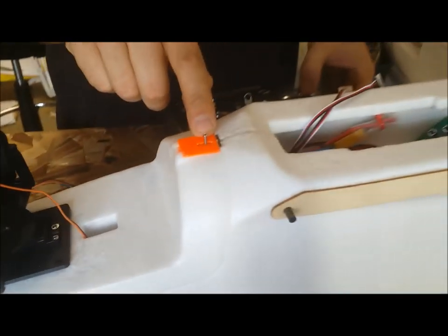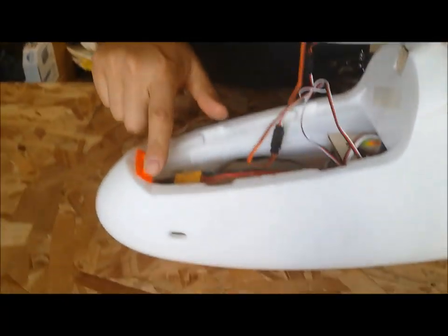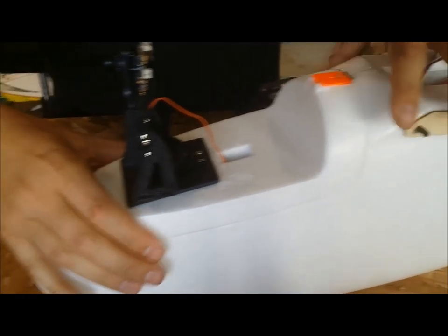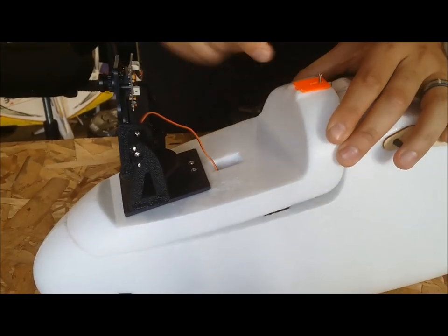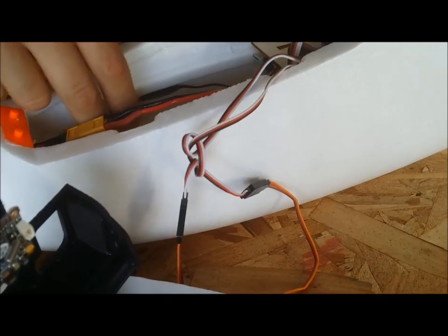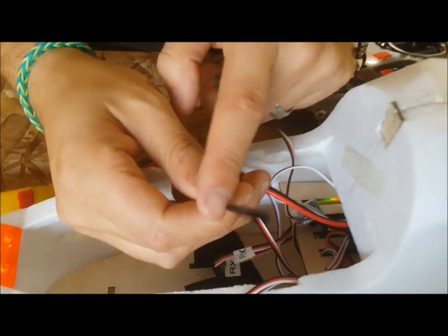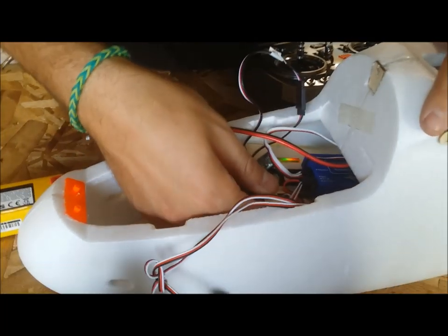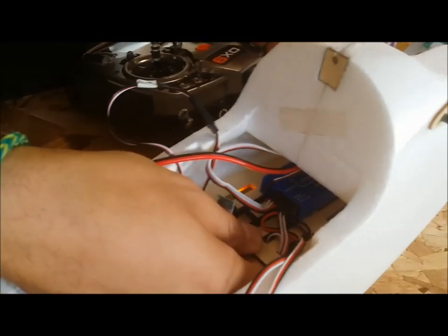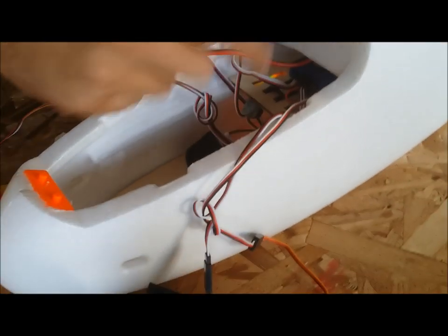One thing you'll notice is the screw on the hatch — I actually lengthened the screw a little bit because the little one included I just couldn't get a good grip on. This is a really nice design. The way the canopy goes in, it locks onto the front little hatches and then locks down — this is not coming off. It's a really nice canopy pod design, not any magnets or Velcro that could fall off or fail in flight. You'll see my two wires for my pan and tilt, plus two additional wires for my video system — camera and transmitter. This is the Cyclops Storm OSD, all nice and wired up. It's one of my favorite OSDs for making nice clean builds, and I'll show you what it looks like with the DVR once I do the maiden flight.